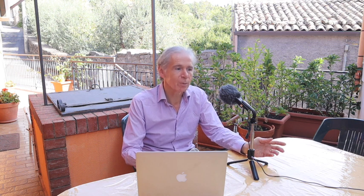So what can you do after seeing this video? First, check if you have a similar stove at home. If your conditions allow, give it a try and clean it, or buy a second-hand stove for a few hundred euros. Keep it simple and start in a place suitable for food preparation where your family feels comfortable. Invest about 100 euros in half a ton of dry wood to avoid smoke issues. If you are not interested in using an oxygen generator for health purposes, invest in a cheap barbecue blower. After a while of using this system, if you like it, you can start integrating it into a wider system. I hope this video was helpful. If so, please like, share, and subscribe to the channel. Also join our do-it-yourself energy group on Facebook by checking the description. All this in your positive energy.